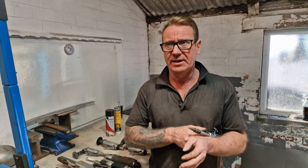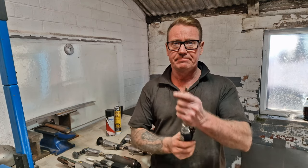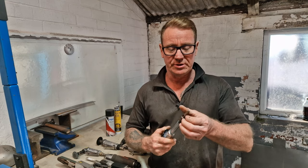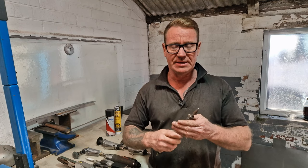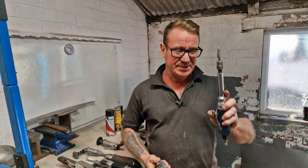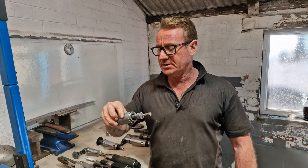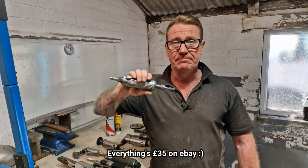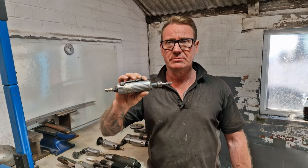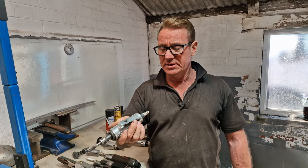Next is the die grinder. If you've welded into a corner and need to shape that weld down, there's no way you can get any of the belt sanders — even the small 10mm one — into that corner. With a die grinder and this piece on, you can shape that corner or get rust out. This is a Blue Point — Snap-on make these — it's got fantastic revs and a handle with long reach. You can also get a cheap Silverline one for about 35 quid from eBay. That one lasted me about four years and is still going strong.